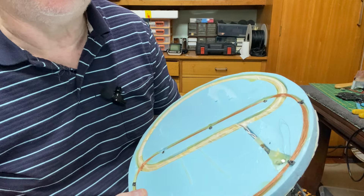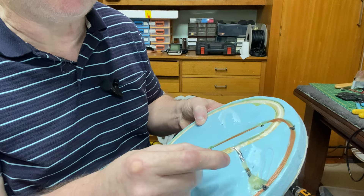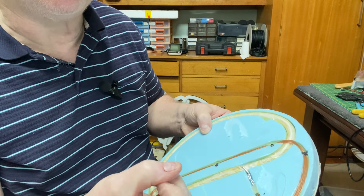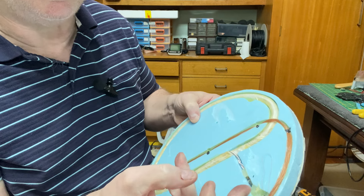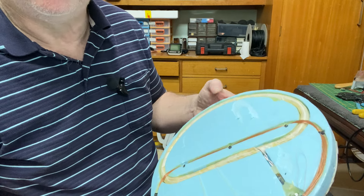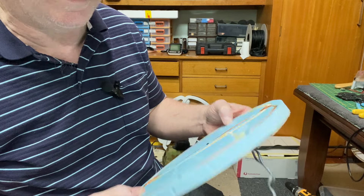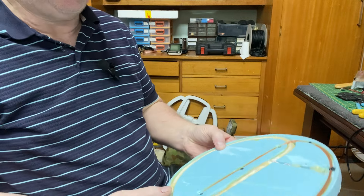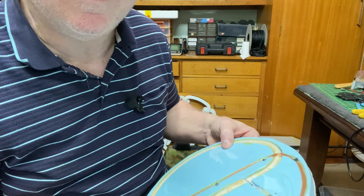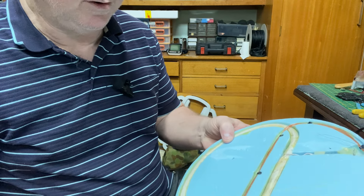The only one I've ever pulled apart is the X coil. They're trying to make any sizable metallic join not get affected by the ground feeding back a signal into a target, which then re-decays in the receive time frame and makes noise in the detector. It's probably a little bit more critical on those detectors. For your solder joints, you want to do them about one third of the way from where the cable comes out — get that solder joint away from your winding, especially on the receive. Twist your wires so it acts as a transmission line and doesn't pick up anything.